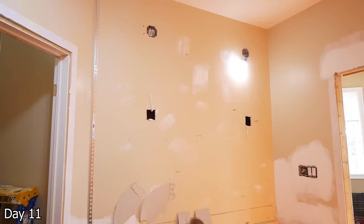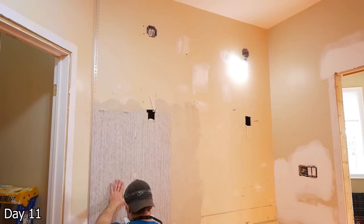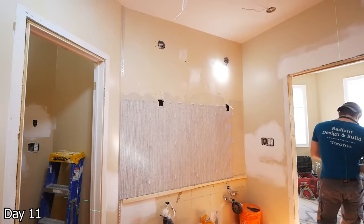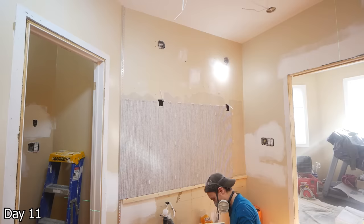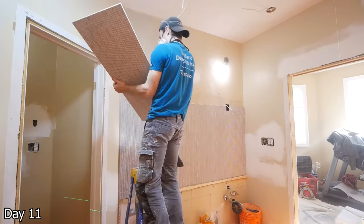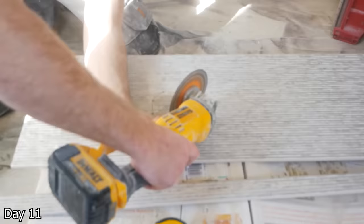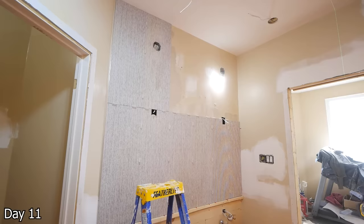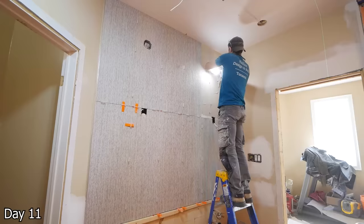I went with this cool little textured stone for the vanity wall here, which I thought was really cool — nice ceramic tile, just kind of adhering that to the wall. I got a ledger board right down below so I can have two full size pieces meet the ceiling, have it really, really tight. Then I only need one piece that's going to connect to the floor on the left hand side, because that's where the vanity will reveal that piece of stone. I'll leave that until the floor is finished so my tile can sit right down on top of that floor. Cutting out the octagon box — just playing a more dangerous game of connect the dots. Was this necessary? No, definitely not. But I just found it satisfying, so I did it anyways. The fixture is going to cover most of the surrounding area on that cutout, so we don't need to be too exact with it.